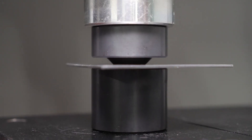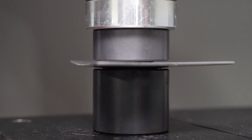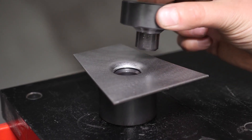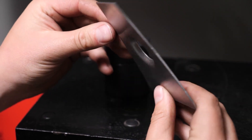Alternatively, if you don't have a press you can achieve the same result using a bench vise, although this requires a little more care to get great results. You will know the process is complete when the resistance on the press or bench vise increases significantly. As the flare begins to form, the sheet metal will initially bow quite significantly, however as we progress and the dimple die bottoms on the work piece the material will become flat again. It is important to stop at this point or you can end up marking softer material like aluminium.